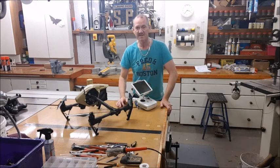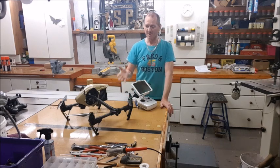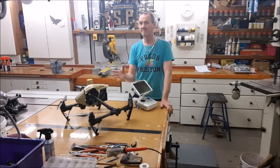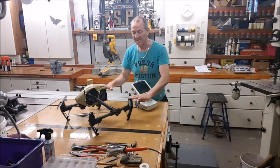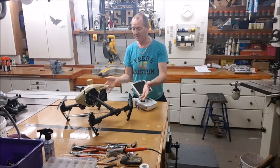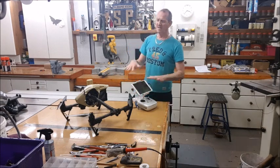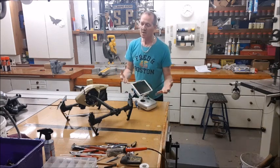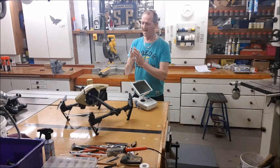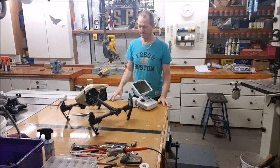If you need any tips, ask me, I might know. I seem a bit of an expert at it now because I've done one, took it apart, put it back together. I certainly won't think twice about doing it again, very easy. Now I've done it, key points to look out for: watch when you're connecting up the antenna aerial cables, very tedious. Make sure you use nut lock where it's required. Silly little things which are quite obvious, but it worked, it's back together, I'm pleased, I'm back in pocket again, I'm not down a drone, which is good.